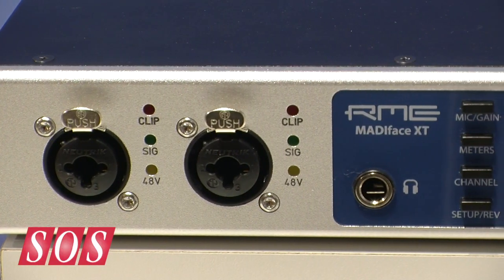Because we wanted to transmit all these channels at the same time, we needed bandwidth. USB 2 is not enough for that. At this time we are maxed out at about 70 channels, which this unit supports too — you can use it with USB 2 and have only about 70 channels transferred to the computer, but you still have access to everything, because all the channels are processed in this unit directly.